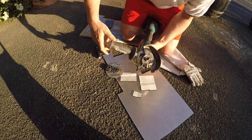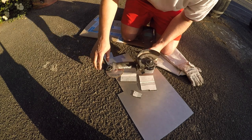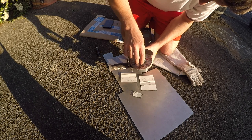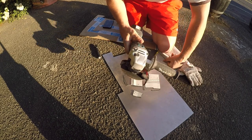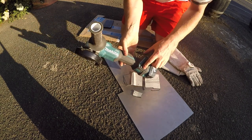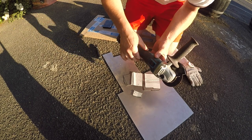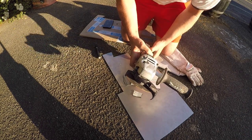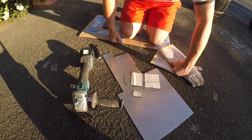I've never ever used the chuck key spanner to do it. It's just tightened up. Really enjoying this — a lot of design improvements. It pulls the air in from down the bottom now, through the handle, so it cools the motor, gearbox, and exits up here. Whereas before, the air intake was down here, so when you put your hand on it you'd actually block the cooling air. It's got a decent battery — just the 3 amp hour, and it lasts quite a while.